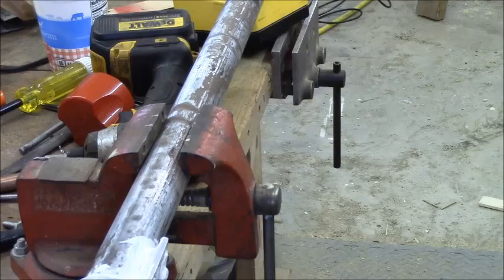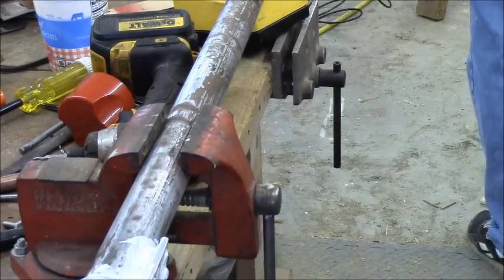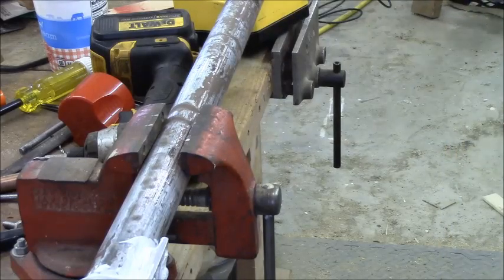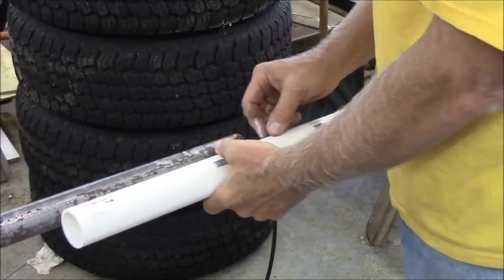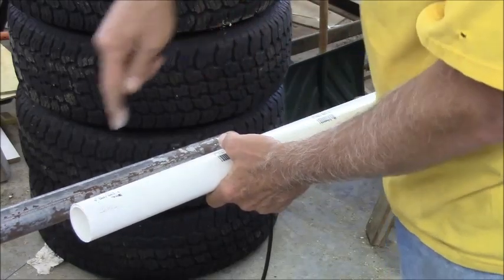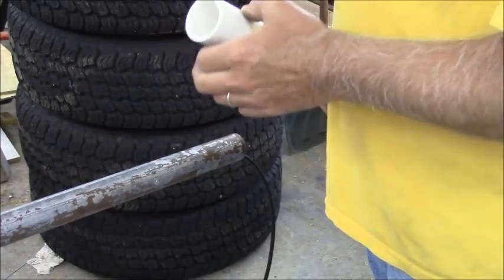I do have one dilemma — I installed all this before I drilled my holes through the pipe, because I had to drill quarter-inch holes through this pipe now for my coupling. What I'm going to do is drill a hole in here big enough for the head of that cable to come out. I'm going to leave about a two-inch gap between the bottom piece and this, and bring the coax out here and then down my chimney. I've got to drill holes through both of these and hope for the best.